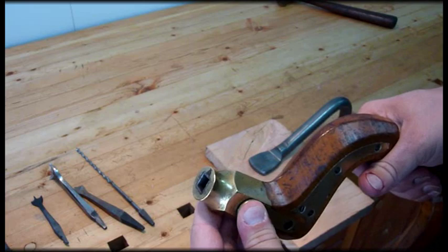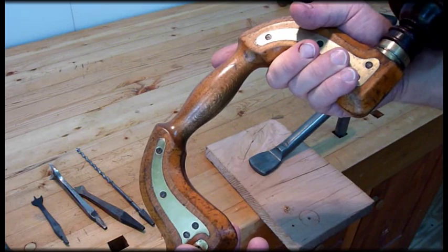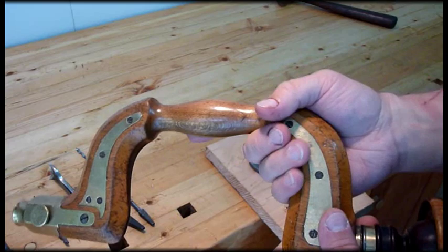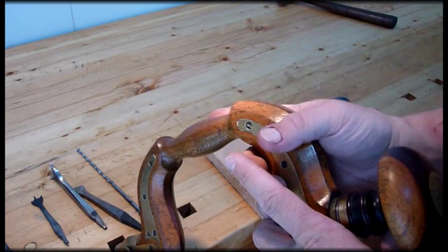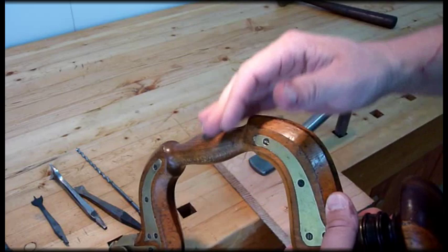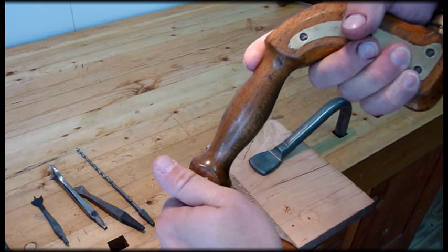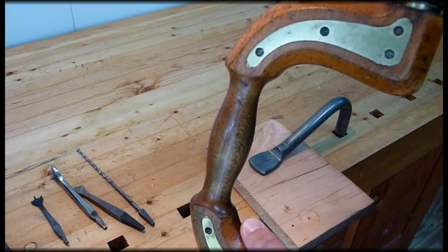You also want to make sure the spring is strong. I have seen a blog where a fellow replaced some parts on his — there's a linkage in there — but it's a really fairly simple mechanism that goes together. The other thing I want to say about these is because this is 1830, so it's almost 190 years old at this point. I would not use this for any real high torque applications, say a one inch auger bit or something that's pretty heavy duty. That's putting a lot of stress on a really old tool. I love using old tools and I try to keep them and preserve them. If I use this on a monster drill bit like that, it could possibly break some of this wood — although this one feels really solid. These platings were intended to help strengthen these braces in the places where they would break most often. You'll see them broken across here, especially the ones that are unplated.